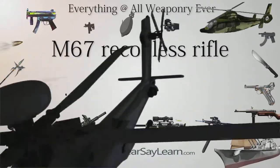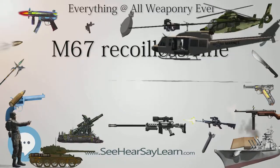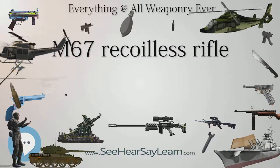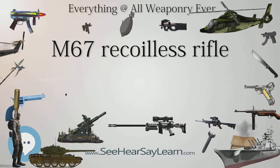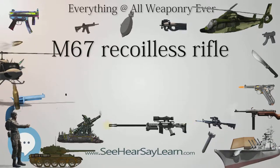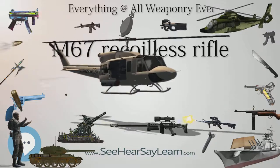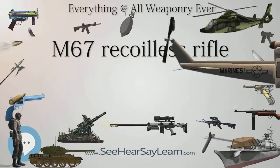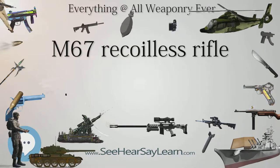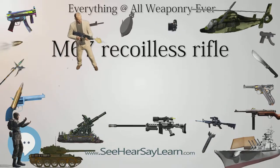The breech hinged on the right side and had to be swung open to load the round. It was then swung closed, and when the rifle was fired, the rear end of the shell case broke up and was blown out of the back of the breech block. On the left side of the barrel, near the sight and trigger assemblies, was an asbestos heat shield to protect the gunner's shoulder and neck from the heat of the barrel when firing. It was capable of maintaining a sustained fire rate of one round per minute, but the weapon could also be rapid-fired at an increased rate of one round every six seconds — 10 RPM — by a well-trained crew.